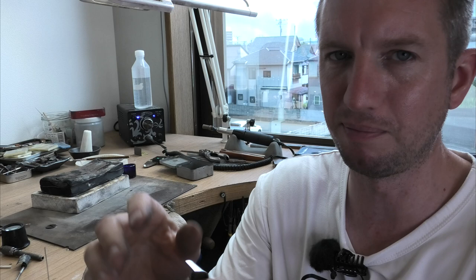Fire stain can be a real problem. On silver skull rings I used to make, I was fighting fire stain on one because of the complex shape with sharp bits — I had to polish hard but very carefully, because silver is quite soft and you can easily make it look over-polished, like a worn-out second-hand piece. Once you've got a patch where fire stain has been polished through a little, it looks patchy and horrible — you've got to do the whole thing. Look out for fire stain; don't worry about ammonia gas chambers, just a bit of extra polishing time — but do it carefully.